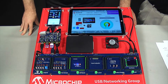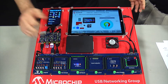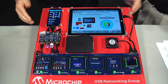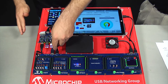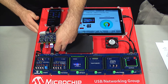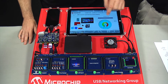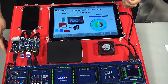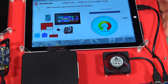In mode three, digital pins are repurposed to indicate the connection state of each individual port. A blue LED shows USB 3.0 communication speed, an orange LED shows USB 2.0 speed, and no LED means nothing is connected. Two extra pins are available for I²C bridging — here connected to a fan controller. We can watch the fan controller speed up, with I²C communication sending commands to turn the fan on and reading back the fan status to display to the user.